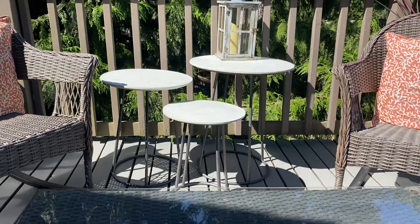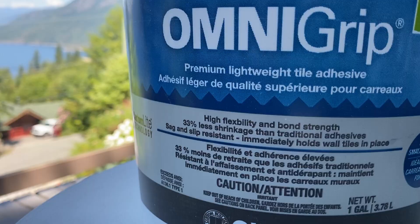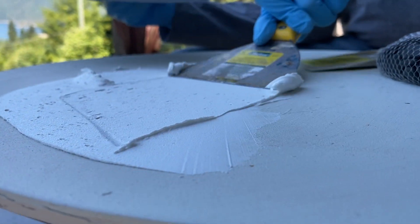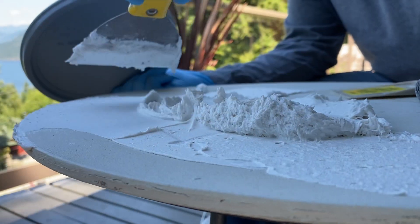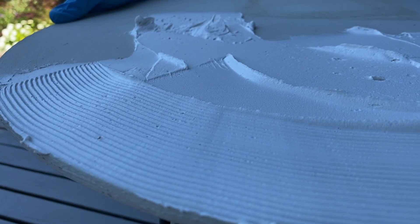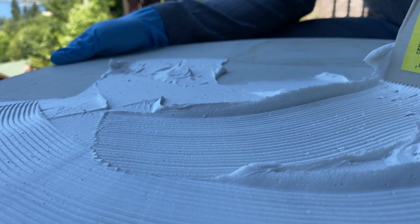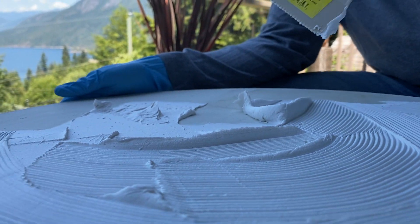I thrifted these little end tables quite probably a couple of years ago and I've painted them a few times. I now have them painted white and I think I want to try something completely different. So with this Omni Grip — it's an adhesive for tiling — I'm not going to use tile. I'm going to apply the adhesive down onto the table and you want to make sure it's evenly distributed. For this kind of project I recommend the metal spatula, which will really help spread it around nicely — almost like whipping butter. The other spatula you're going to need is the plastic one with the comb end, which creates a groove line so the adhesive can grip what you'll be applying.